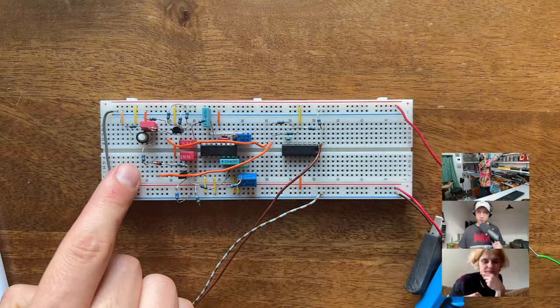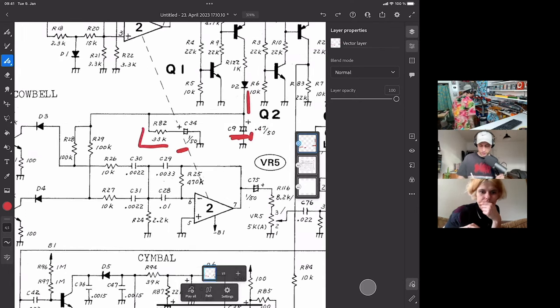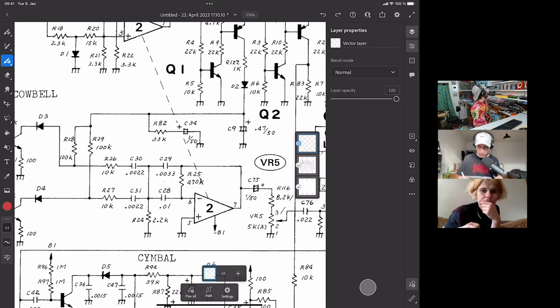Yeah, so basically right now we are only using this capacitor here. And this capacitor is being fed the trigger voltage directly. Then once I let go of the button, it discharges in this direction and into these two VCAs. As it discharges, the VCAs open up. Then the voltage drops, because the charge leaves the capacitor and so the volume dies down. If we do it this way, then the cap discharges quite quickly because it's not very big, and it has two paths to go through. And so it dies down. It's very quick and percussive.